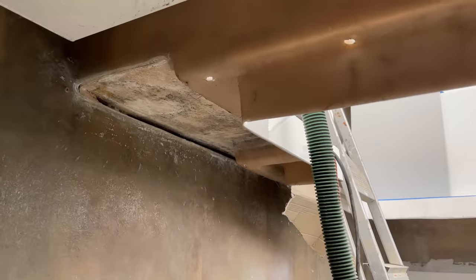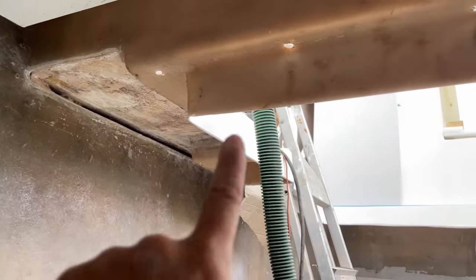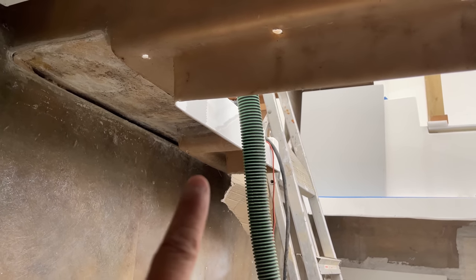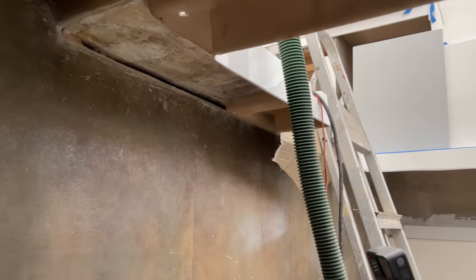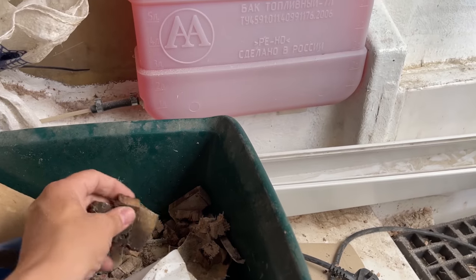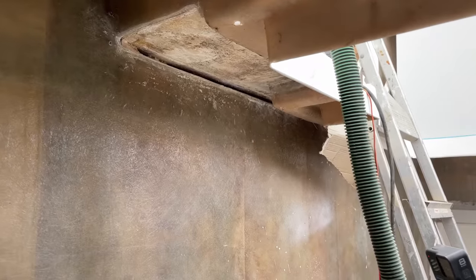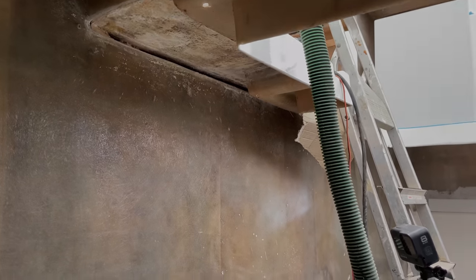While he's been doing that, I've just dug out all of the rotten balsa. We've got some rotten balsa in here — this is actually the pickup point for the engine bay cover, so it needs to be nice and strong and we've got a little bit of flex. Off camera I've just taken all that balsa out and that's all prepped ready to go. In this bucket you can see all the rotten balsa that was in there — that definitely needed to be dug out. What we're going to do now is leave that for a few days to make sure it's fully dry, and then we'll come in with some more balsa and glass all that back in. That will be a nice repair.